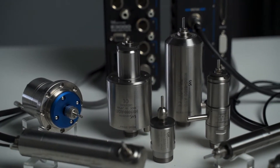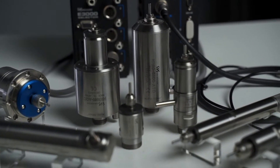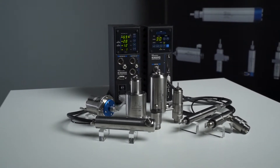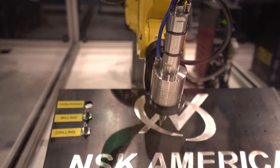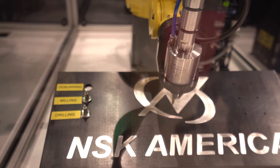The NE211 control and the NE211 selector unit work together with the modular system. The controller is one unit and the selector is the other, allowing you to run up to four spindles on a machine or robot. Our spindles are normally used for milling and drilling, but robotic deburring is becoming very popular as well.